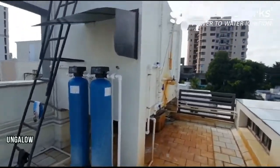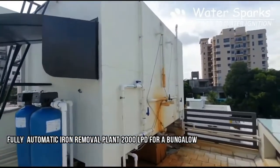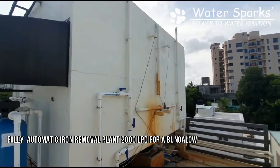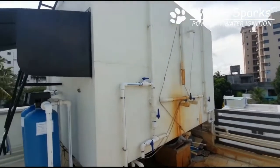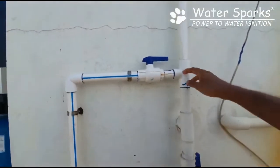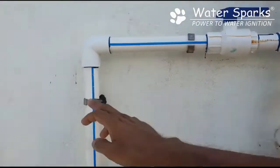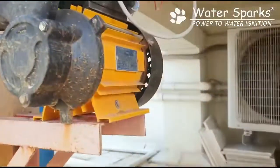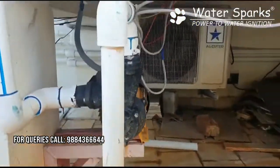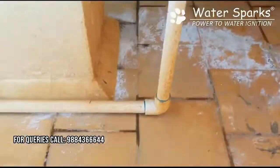What we have done is taken this actual overhead tank and split it into two parts — one is made an aeration tank and the other is a treated water tank. From the aeration tank, this outlet pipe takes a one-inch pipeline down to a half HP motor below, and from that motor the water is pushed through the pipeline up into the filtration system.